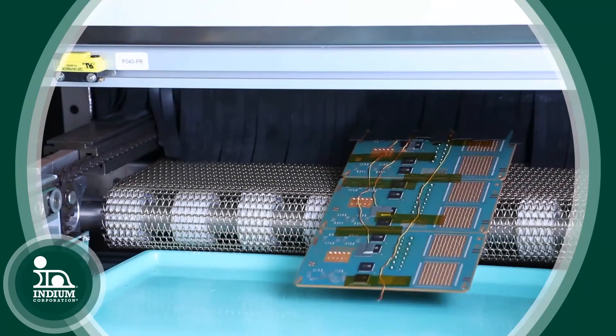Is it jettable? Is it dippable? Do you have longevity of the material? Are you able to pass electrical testing? And finally, are you able to prove that you have compatibility between the residue and the underfill material? We're talking mostly about molded underfills, some capillary underfills as well. Molded underfills typically are very difficult to have compatibility with because they tend to be applied using a hot pressurized process, and that very high temperature seems to decrease the compatibility with any flux residues left behind. And so we now have customer data that proves compatibility with the flux residues that are left after reflow.